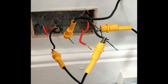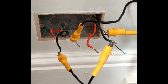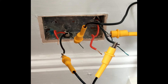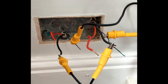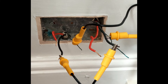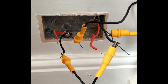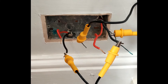At least it's solved the CPC problem — I'm getting continuity, though not the values I would like. I'll zero my tester and get some proper readings. But I've got a funny feeling there's actually more going on here than meets the eye. It hasn't solved the problem on the line — when I connect up the line and neutrals together I'm still getting an open circuit, so the line break is somewhere else.